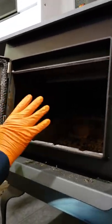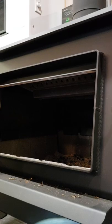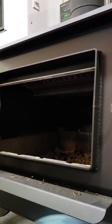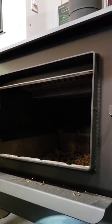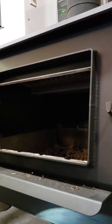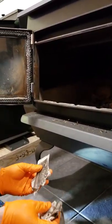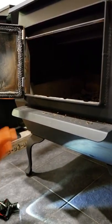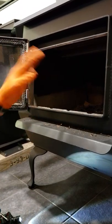So what we've done is completely taken out that catalyst, checked it over, made sure there was nothing inside. If there was anything built up inside that catalyst, we could vacuum it out. This one was actually perfect. So we put the new gasket on — that's the old gasket that comes out and you can see how it's just brittle. We put the new gasket back on, surrounded it with some masking tape, and put it back in. Watch out for the two guards on each side because they can fall off — you can shove them inside.